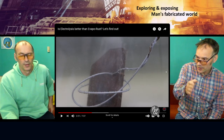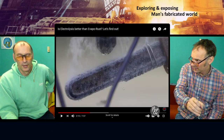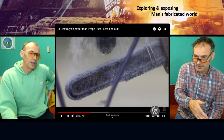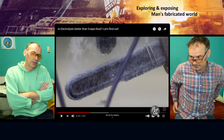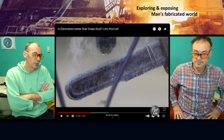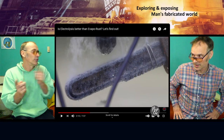He's saying that the hydrogen's coming off the steel, but that's the anode. Yeah, he's got his anode. You don't get hydrogen off the anode. Sure. What the guy's done is he's looked up the electrolytic process, hasn't he? Obviously done a little bit of research, but he's got his anode and cathode the wrong way.